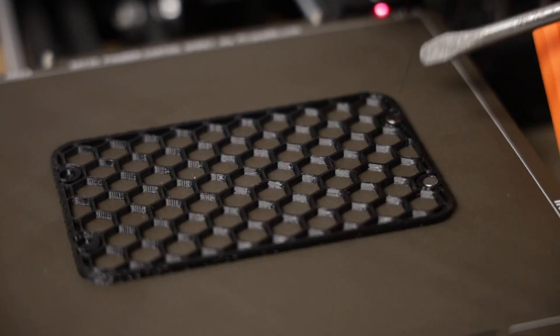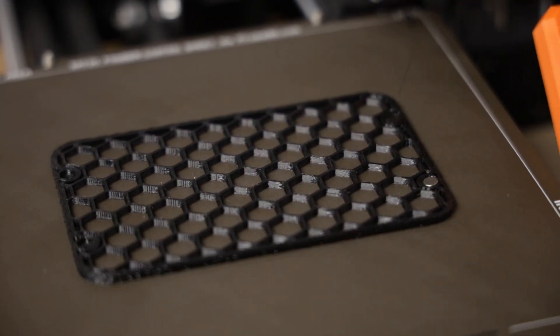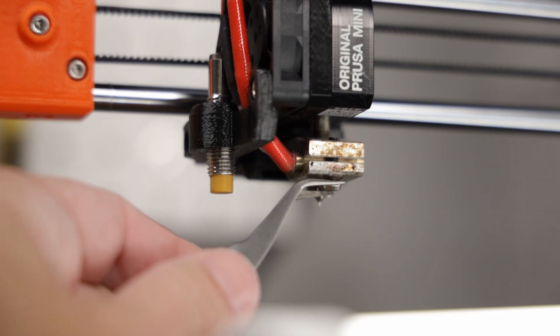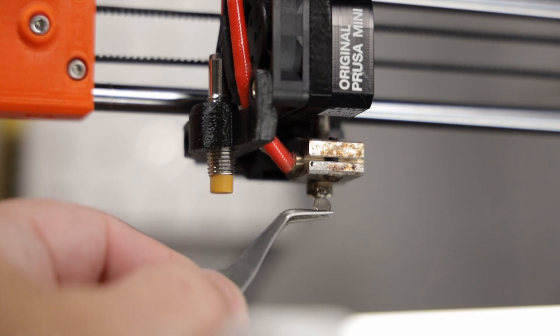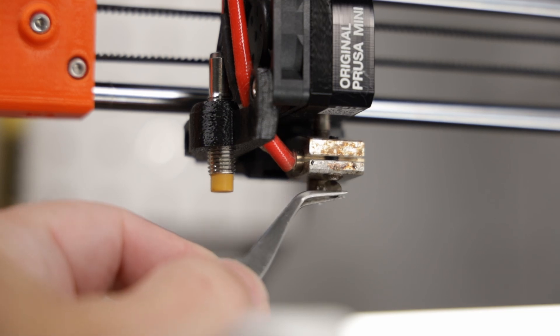You want some resistance for the magnet to go in, but you don't want it to be too loose, because the magnet can jump out of the hole and stick to the hot end if it is too loose, especially if you have a hardened steel hot end since brass is not magnetic.